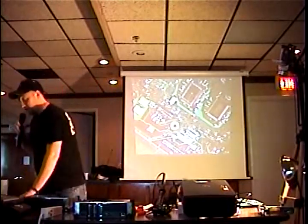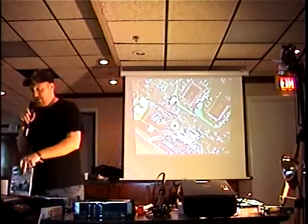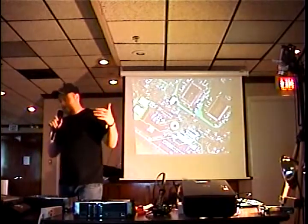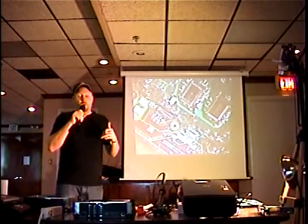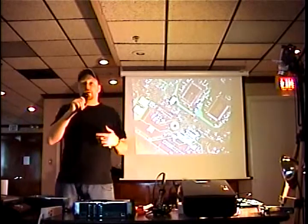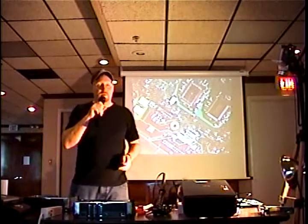So if you've got everything together and you've got it on the screen, go ahead, eject the tray, and put in the 007 Agent Under Fire CD or your Mech Assault CD, whichever one you're using. Don't push the tray back in yet, because it'll start the game up, and that's not what you want to do at this point. You want to go into the Microsoft dashboard, go into memory, and transfer that file from the memory card to the hard drive.